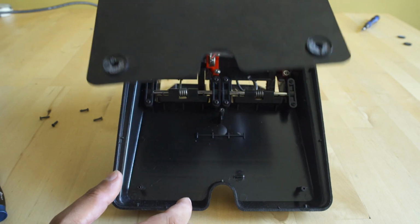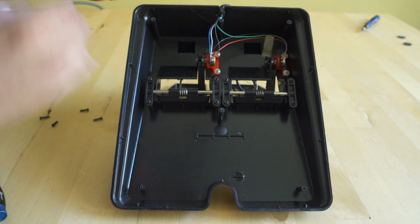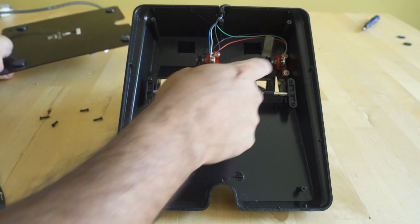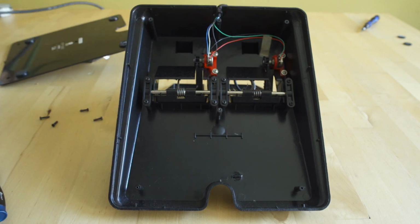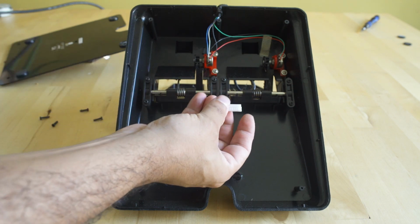But now that we're into the bottom of the brake and gas assembly, we're going to see the 2 potentiometers, as well as all the different wiring we need. We've got our ground wire, we've got our plus 5 volt wire, and then we've got our signal wires from both potentiometers, so we're going to be able to take that data out of the potentiometer and get it right into the arcade PCB, so we're able to control both gas and brake through those little plastic connectors right there.